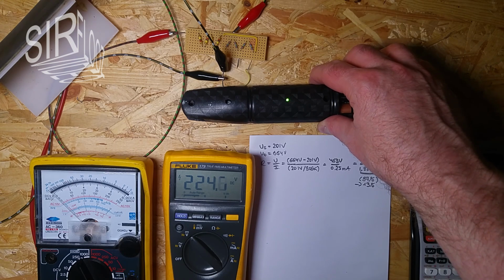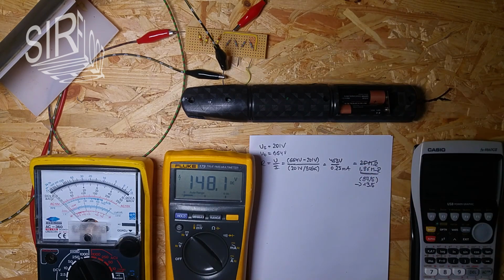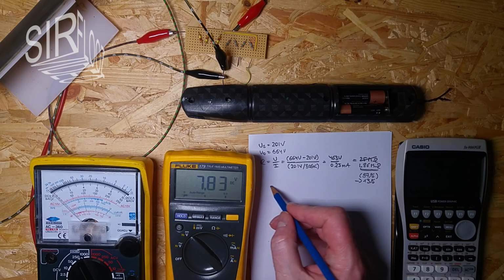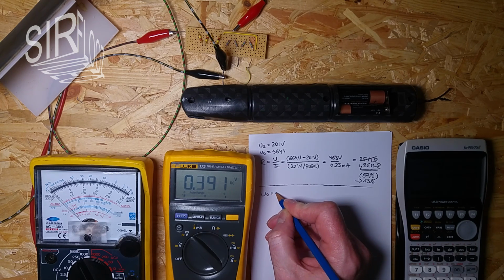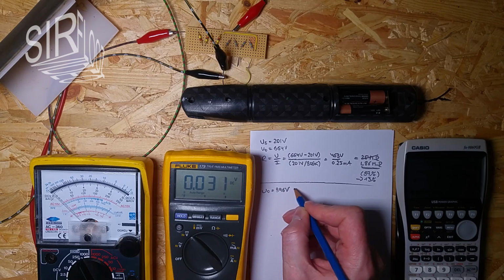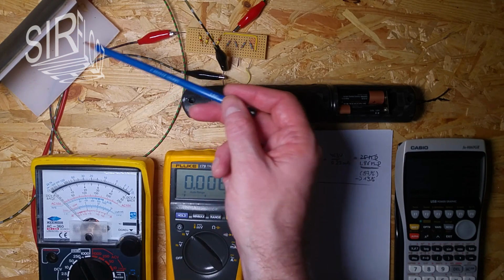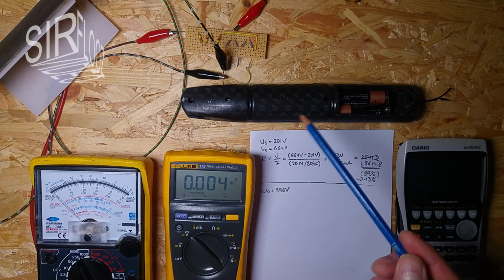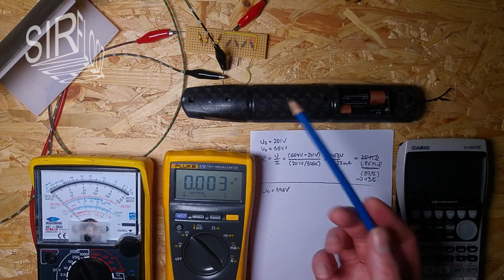Okay, now we have a voltage, 25% voltage of 224. So 224 times 4, which gives us a total voltage of 896 volts. Because, yeah, you see the voltage is not stable because it heavily depends on the load. And the load resistor is now much higher, I assume. And yeah, that obviously leads to higher generator voltage because it's not loaded so heavy.